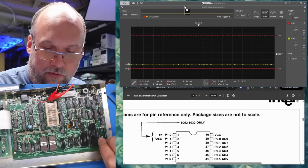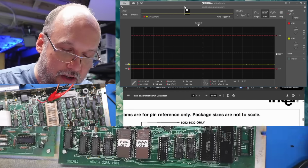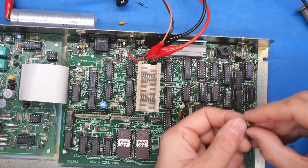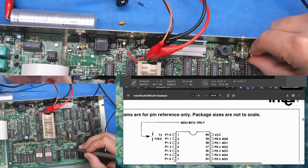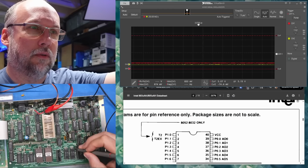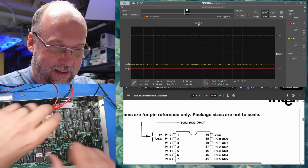You know, I don't have this motherboard fully screwed into the case. I just have one screw holding it in here just because I didn't want it to kind of slide around. Is it possible that these screws somehow ground the board and the ground plane is split or something weird like that? Okay, here we go. Let's try again. No. Okay, that made no difference. The problem is somewhere else.